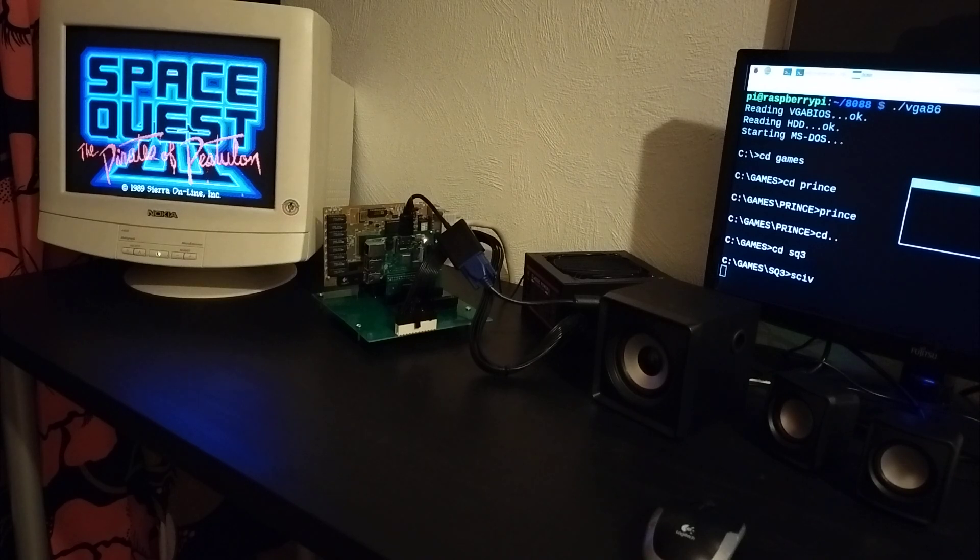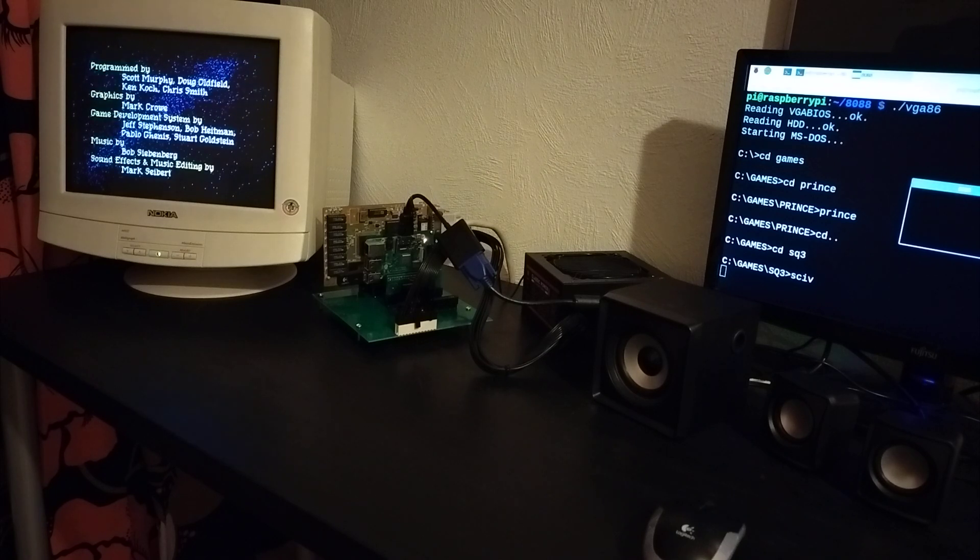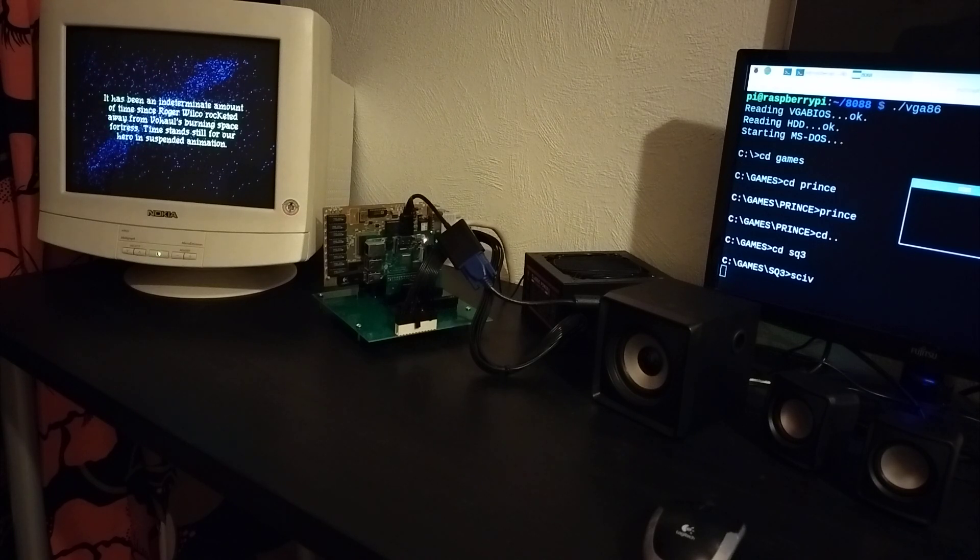It's a bit slowed down — I should optimize my emulator a little bit. Also, this is only a Raspberry Pi 3. There is a PCB that supports the Raspberry Pi to ISA bus connection, and it contains only a single chip with basically no other components — just a pull-up resistor for the ready signal. The chip on the PCB is a latch, because with 20 address lines, 8 data lines, and 4 control pins, the Raspberry Pi's 28 pins require latching for the higher-order bits of the address. But that's pretty much all there is.